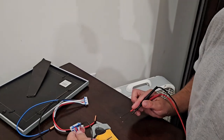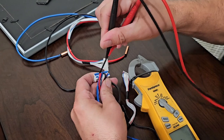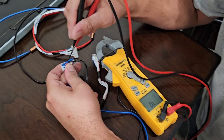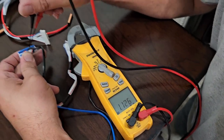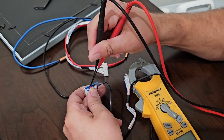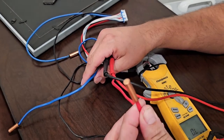These are the set of old sensors we've taken out. We're going to measure the red, the blue, and the black. First, insert the meter leads on each one of the red wires — that's a coil sensor. It reads 0.7. This is a 10 kilohm sensor, so that's low. Now the blue: it reads 10 — that's better. Now the air sensor, which is the black wires: it reads 10. So we had 10, 10, and the first one we read was 0.7. Which one's bad? This one right here — that one's bad.